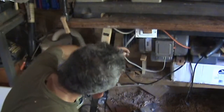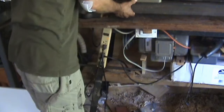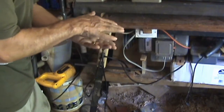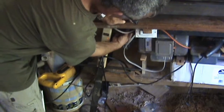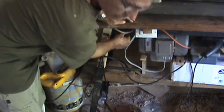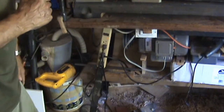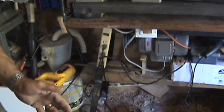It's fairly tight. So what I want to do is, I already unbolted my lathe, so I can knock it back out of the way, tilt it on its back, and be able to drill the 4 holes that I need on the top of this and pull that motor up. And to pull it up and to keep it solid so it's not rocking, I will fill up whatever difference I need in between the bed and where I can't get the motor up anymore. I know that this is not that hard of a metal, so I'll be able to slide it up maybe about 3/4 of an inch up on that, and I'll probably need the shim on the top of that another 3/4 of an inch to make it solid between the two, and that will give me ample room. So let me tilt this out of the way and let me show you the progress on the next step.